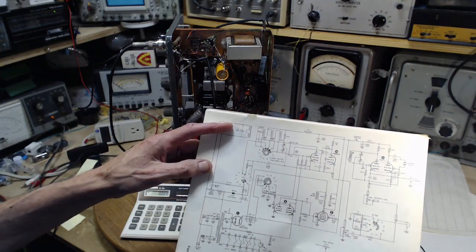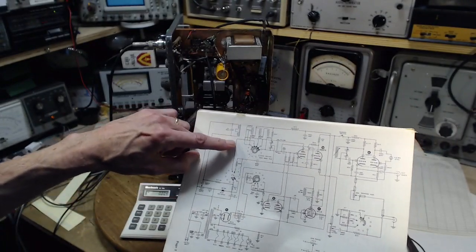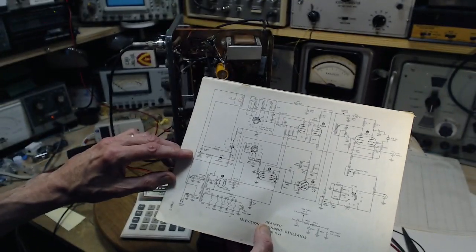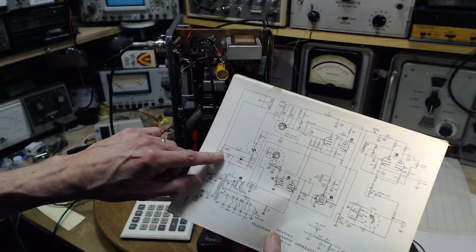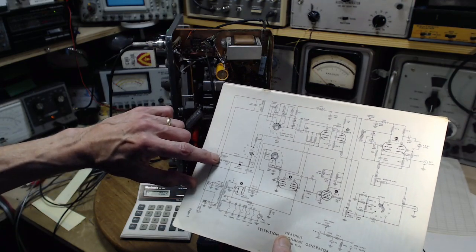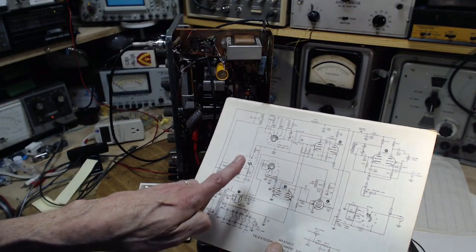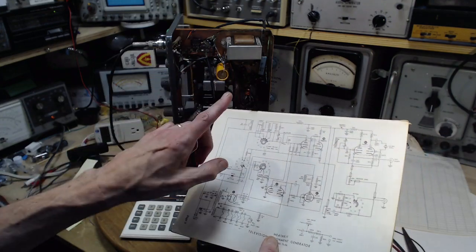What they've done, I believe, is use a bias to cause a steady current flowing through it, and then they superimpose the AC signal, which they're picking up from the transformer here, selecting how much you want to send forward with this control. They fire AC on top of the DC. The result is you never reverse the current, you simply vary the amount of DC, because the two things are going to add, right?